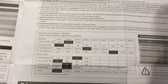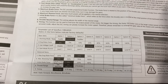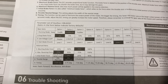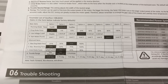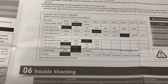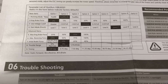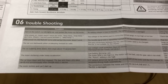Some of the things you can adjust: running mode — forward only or forward and brake only — adjustable drag force, adjustable low voltage cutoff so when your LiPo gets low it'll shut off and not destroy your battery. It's got punch control, which is basically the instantaneous power applied when you first pull the trigger. Also drag brake force, reversing force, initial brake force, throttle range, and adjustable timing. I don't think my V2.1 had adjustable timing, so that's a nice addition.